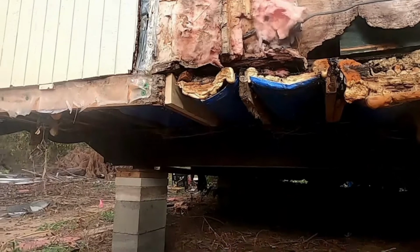Yeah, like a glove. Now you can see that nice overhang back there, so that's going to be supporting things better. It's not that these are that bad right here, it's just the tips are rotted out, so the connections are bad, right? So I'm going to sister them and screw them together after I'm done here. So yeah, here we go.